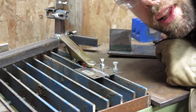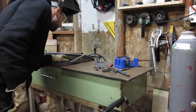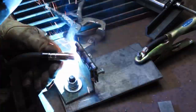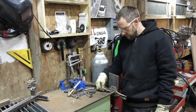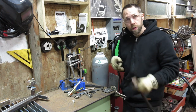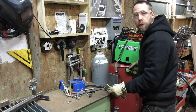For any of you concerned about welding some zinc plate and galvanized stuff here, rest assured I've got a super loud fan above me — that's why I'm yelling so loud. When I was picking out hinges at the local weld shop, they had a few that aren't coated so they're not bad to weld on. But all the hinges had a bit of slop in them, so I'm going to take a punch and try to pin them a little tighter. That tightened it up quite a bit — now there's a lot less slop. It's stiffer now too, which is fine.